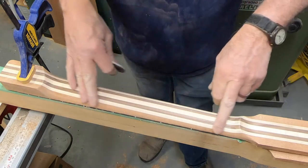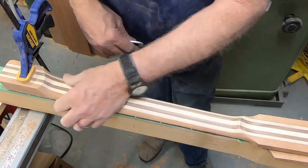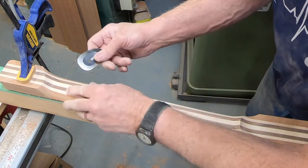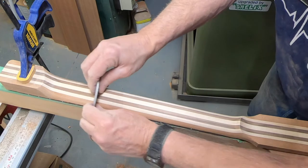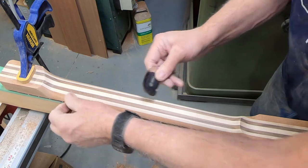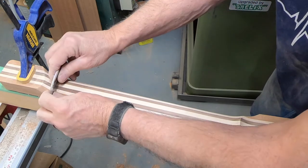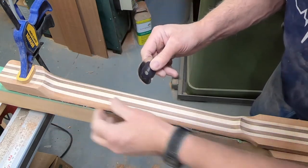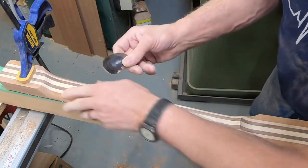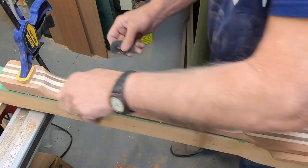I'm still feeling a little — I just noticed before I turned the camera on kind of a ridge right there, which I don't have on this side. It's basically right where the walnut and the maple meet, so I'm just going to peel that off a little bit. When you use edge tools, you can tell if you're going against the grain or tearing something up, so you just don't go that way. I've been able to go back and forth on most of this, though I had one layer right in here that didn't like that.